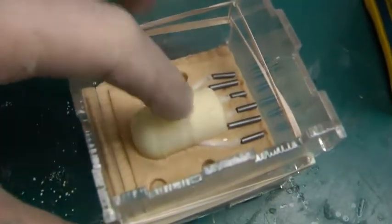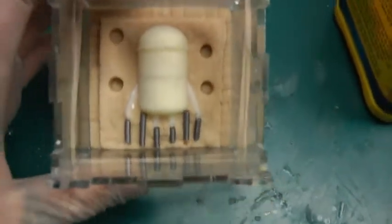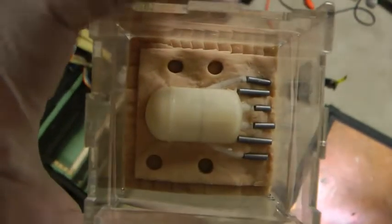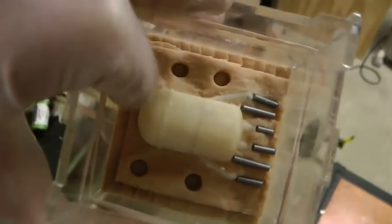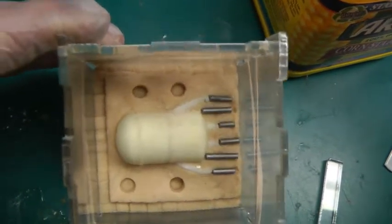We are going to make a mold of this guy. He's on Thingiverse. The first step — I kind of skipped ahead a little bit because it's really easy. First thing you need to do is go to MakerCase.com and measure out your part. In this case, I have Nurdle here and he's about an inch and a half tall. I provided enough room, maybe a half inch on all sides, maybe three quarters of an inch if you're new at this. I put some Sculpty at the very bottom, and then pressed him into the Sculpty so he's exactly one half into the Sculpty.